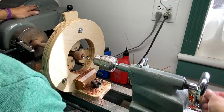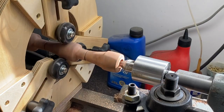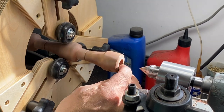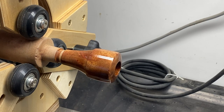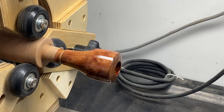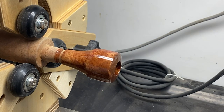This is working so well. Once I have the counter bore and the through hole all the way through the knob, I can use the steady rest once again in conjunction with the live center, get everything centered, move the tailstock out of the way, and now I can begin to sand, polish, and finish. This thing turned out fantastic and I am super pleased with this little project. What do you think — looks good, huh? The wet look. Yeah, it's gonna work. I'll cut that loose and we're done. Fabulous.